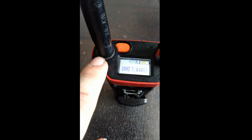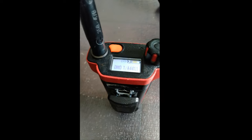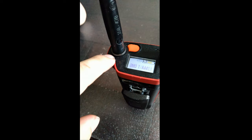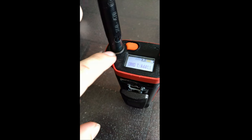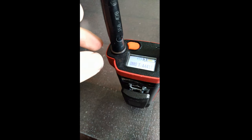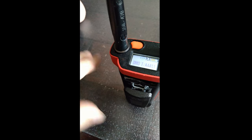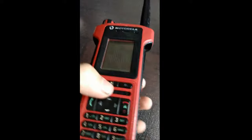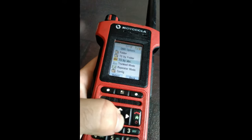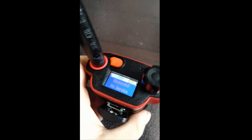Now we're in repeater coverage. It was flashing orange earlier because there was apparently a message that failed to notify me about. If you're in TMO this will be a solid at-a-glance RSSI indicator. It'll be solid green in good coverage, solid yellow in so-so coverage, and solid red or flashing red when out of range. I can demonstrate out-of-range — there's trunk mode and there's the top display showing low coverage going to out of service.